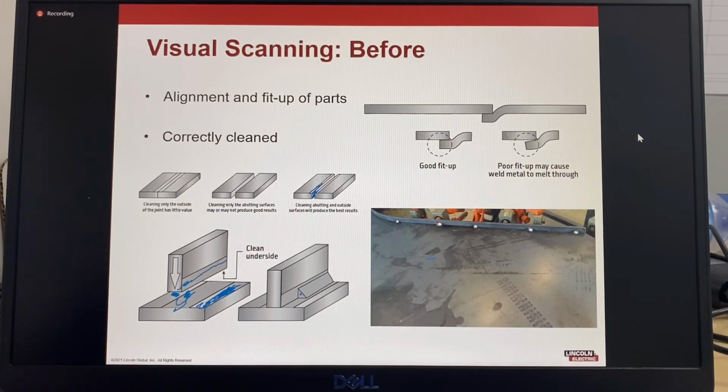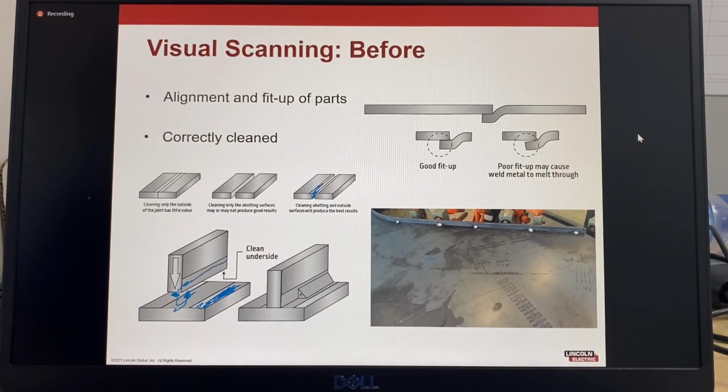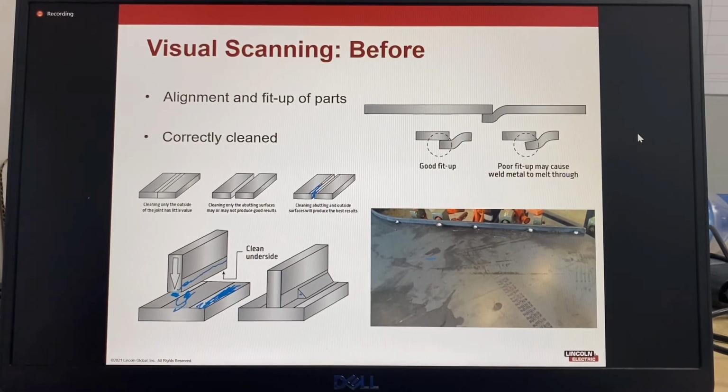Things to consider are the joint preparation, the inspection, the pre-weld setup, correct joint alignment, the metal surface condition and cleanliness, the metal temperatures prior to welding, so if pre and post heating practices need to be applied, the shielding gas type and also protection from any drafts if you're in an open workshop, preheat verification, temperature and heating method, the presence and location of heat treatment monitoring devices. All of these need to be considered and looked at.